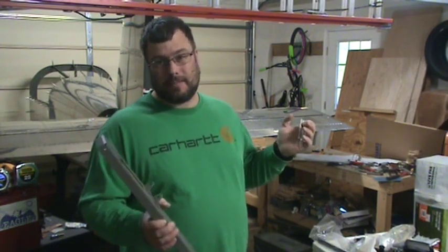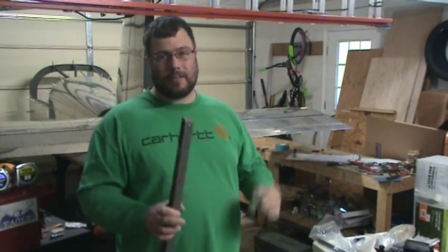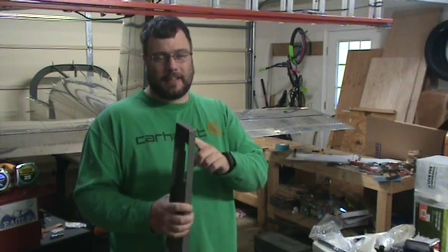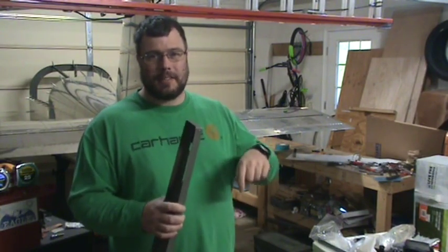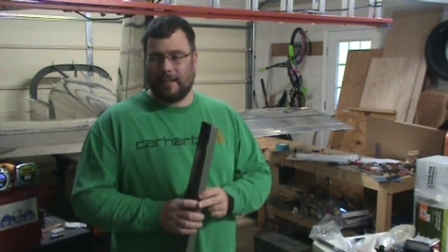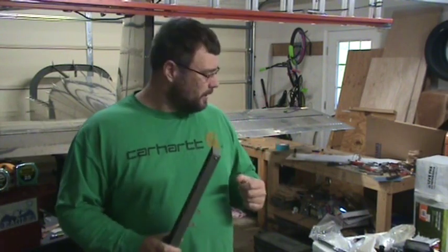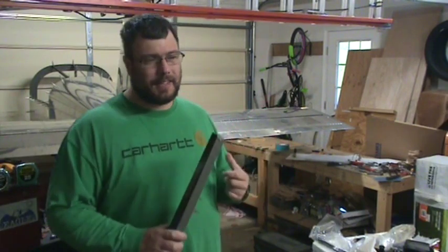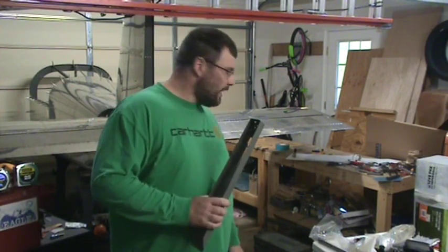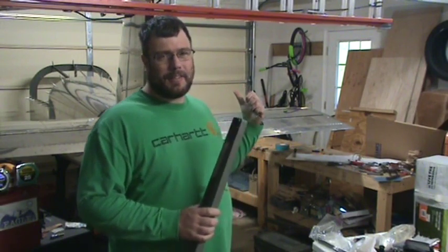If I had a drill press, it wouldn't be such a big deal. You clamp the piece, you drill, the drill bit's not going to wander that much. But since I was drilling by hand, even though I center punched and then drilled, I still had the drill bit cut uneven and walk on me for some reason. I think maybe my quarter inch is defective, because it happened exactly the same more than once. And it didn't seem to cut so well when I used it back on installation of the static ports.